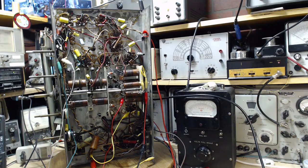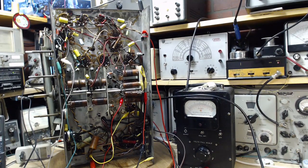The warning in the manual for this radio is that if you use one of those, there's a chance the oscillator won't oscillate. And why is that? Well, because you've hooked up extraneous cables and changed the impedance of circuits and so on. What that says to me is the oscillator is very sensitive in this radio, and if things aren't quite right, a little bit out of sorts, it might be enough to stop it from oscillating. I would think it's the higher frequencies that would be more precarious, and sure enough, the oscillator won't oscillate on the two highest bands. So that implicates things like component position.